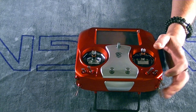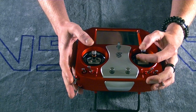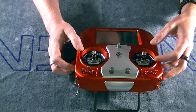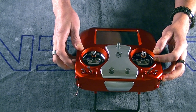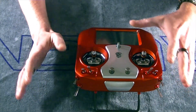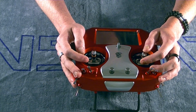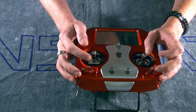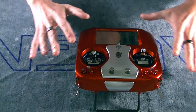Spend time on it and get it where you want it to be — get it perfect. By adjusting those you can also adjust the overall tension and the spring tensions. The cool thing about these gimbals is if you're using mode 1 or mode 2, I believe it's setting number 5 or 6 — read through the PDF — but one of them, the more you tighten the screw, it brings your stick back to center. You can then loosen the corresponding one and switch over from mode 2 to mode 1 or from mode 1 to mode 2. Go ahead and get all of these adjusted.